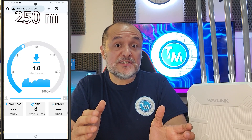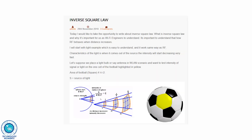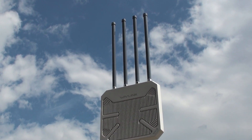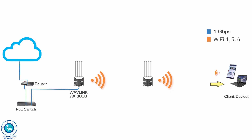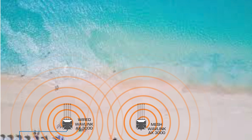All of this was expected — Wi-Fi coverage is governed by physics. The inverse square law shows how signal strength degrades over distance, which is why powerful access points like this one compensate with big external antennas. At this point I could only imagine what range we could get from a mesh network — placing a repeater where signal quality is still good would provide strong coverage for very vast areas where the limit is no longer coverage but the number of clients admitted by the device.